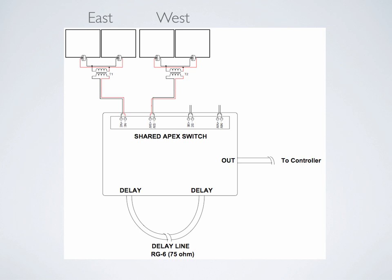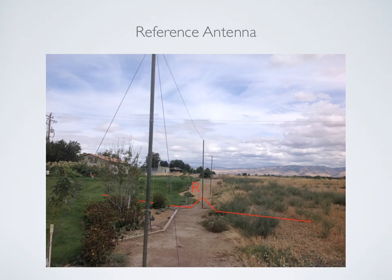Schematically, we have a first loop pair connected to the northeast terminals and a second loop pair connected to the southwest, with an isolation transformer for each pair. The delay line is connected — in this case the 35 nanosecond delay line. We also include a reference antenna to provide a nominal antenna with nominal directivity as a comparison. That reference antenna is shown in red, designated with the letter R, and each leg is 20 feet long, running orthogonal to the array.